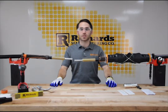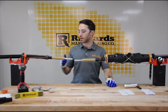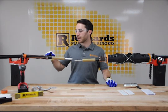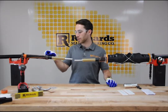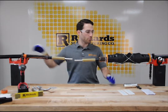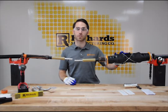We're ready to start the installation. We have gone ahead and prepared our cable per the supplied instructions and verified that our dimensions are correct. In this case, we're using jacketed concentric neutral cable. We've applied a jacket mastic - a butyl sealing mastic - just back of the jacket cutback, and we've folded our concentric neutral wires back and secured them on both sides. We've parked the splice and are ready to proceed to connector installation.